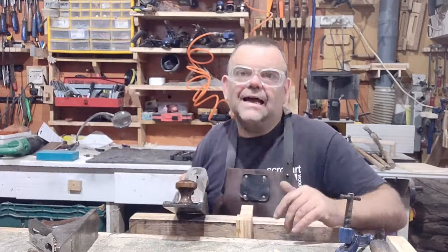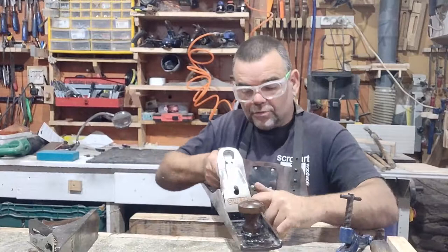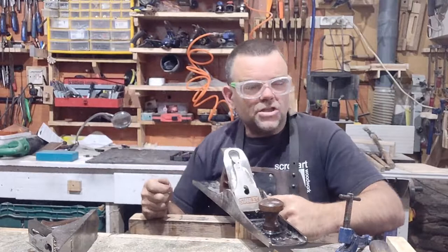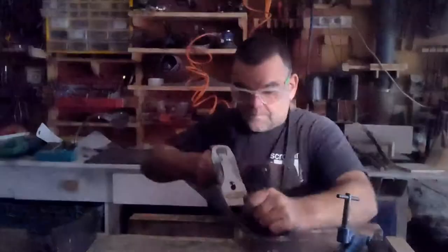So what I'm going to do is run the plane over the end of the piece of wood at a slight angle — not straight on, at a slight angle — so you're getting that slicing action. Like with a knife, you wouldn't necessarily hold it at 90 degrees to your workpiece; you want it at a slight angle to cut the fibres better. With end grain, you tend to have it at 22 to 45 degrees, as long as you're covering the end of the piece of wood.